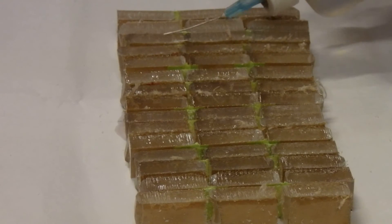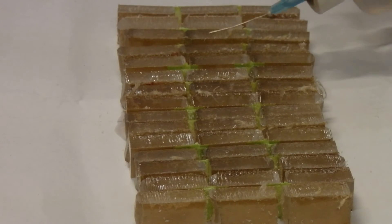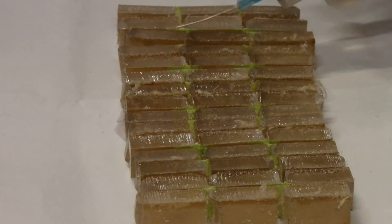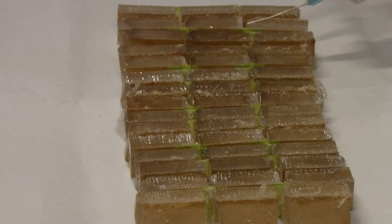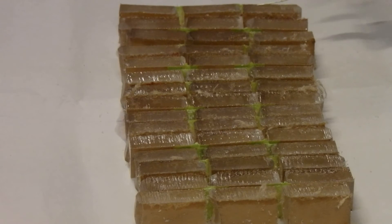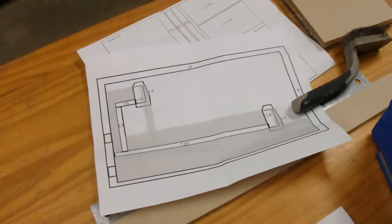Now I've got to do the same kind of operation for all the big pieces that go beside them. These are half-inch; those will be three-quarter. Same deal — cut out a whole mess of three-quarter strips, this time out of an inch-and-a-half strip so they will be a quarter-inch taller above and below, just like in my drawing.